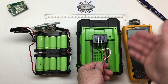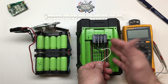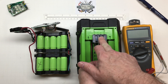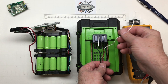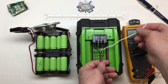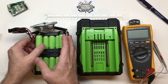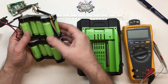We know that D, I assume, is for detection — so temperature and detection. One thing I found out is the D: the boards actually talk to each other through it. The T terminal — the tool really doesn't typically get the T. I don't know if the lawnmower does since I haven't had one apart, but I would think some of your heavier loads may get the T as well. The charger does look at T, and the battery pack also has some other thermistors on the pack that do some monitoring.